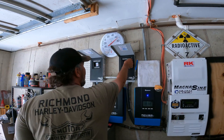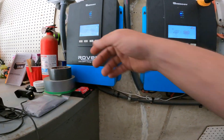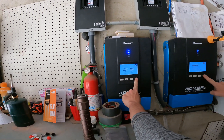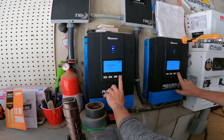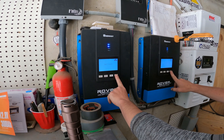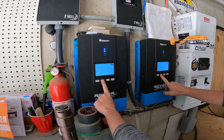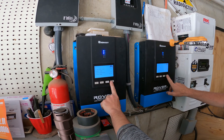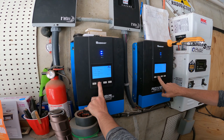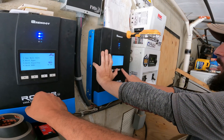These are the breakers for the solar panels, so they'll feed power to these charge controllers. And I'm going to get in here and make some adjustments to the settings real quick. So we're going to parameter set — I've got to enter my password here. Now we're going down to battery type, which is going to be lithium, and the battery bank is going to be 300 amp hours per bank. We've got to split between them, so we're 600 total — the batteries have comms between them.